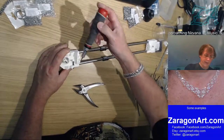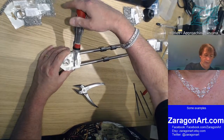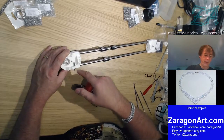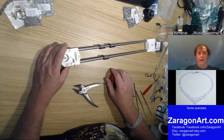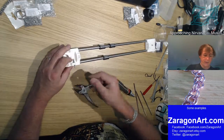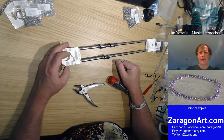And I gather that the bottom is the actual, probably the bottom. It will then press against the end stop of the micro switch, which will tell it where it is. And you adjust it obviously by screwing this up or down. Right, so we've added that bit in, and it's tight enough for the minute. That's fine. And now we do the x-axis carriage.